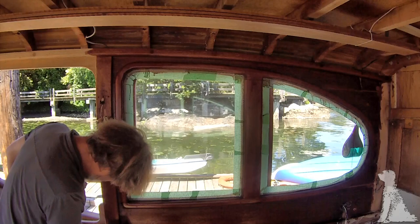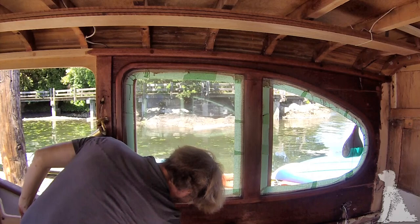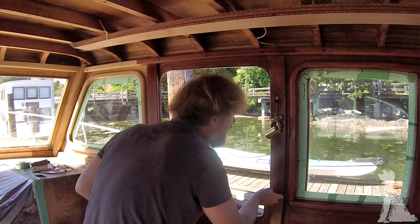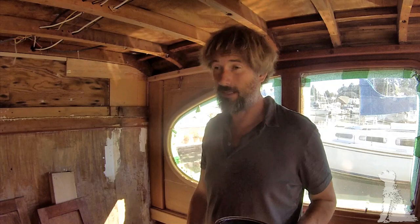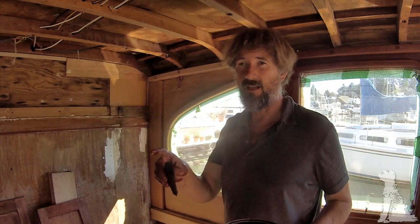So far, I can say that the stainable filler and the wrong bungs I've used have stained quite nicely. That bung right there isn't the right color, and it seems to look just fine. That's all going to be covered up by kitchen counter — I can hardly bear to do it now. Let's put some more stain on. You can sort of tell when you're getting into trouble — you can start to feel the stain dry, and it starts to drag under the brush or sponge or whatever. I brought you back for the last section. This is going really well. Really, really well. Fast, easy. The stain is very forgiving. Got to keep swirling it a bit because it seems to be separating a little bit in here. I really have nothing to add other than mop it on, wipe it off, and it looks like a million dollars.